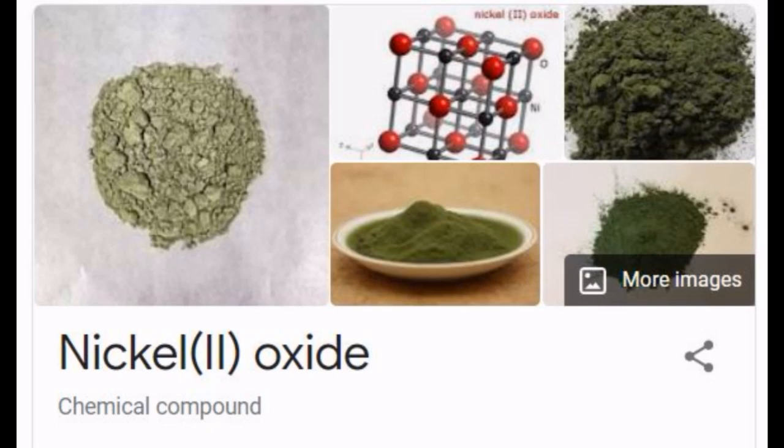The information from this test is going to be used to prescribe a flux recipe suitable for an anode sludge that has not been exposed to an acid leach — we're trying to avoid that as much as possible. We're definitely learning what not to do here. I was expecting a lot more metal out of that anode sludge, but no matter what I do we're getting pathetic yields — I'm not seeing any economical feasibility. It's possible, but it's kind of like flying a rocket across the country versus taking an airplane. I've got a lot more testing to do. The next step is we're going to use a collector metal, but that is a hazardous process in itself. So we've got some soul searching to do here.